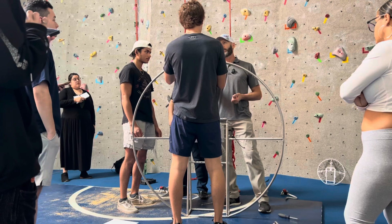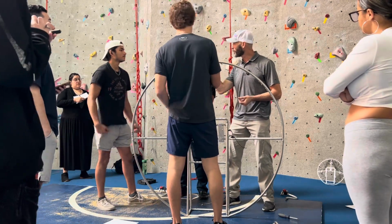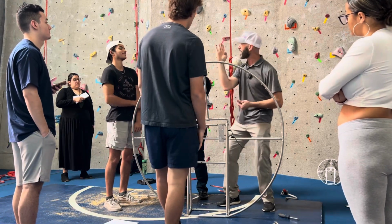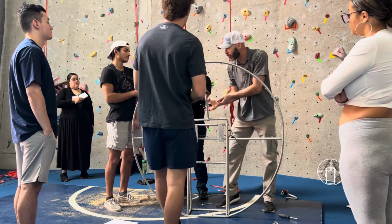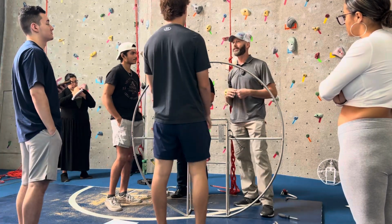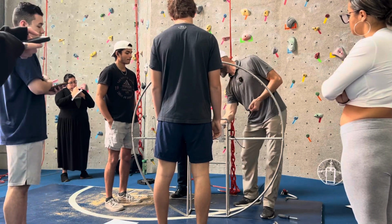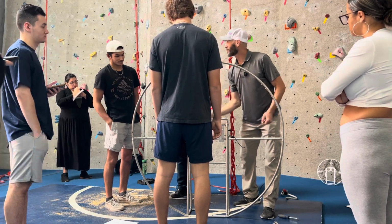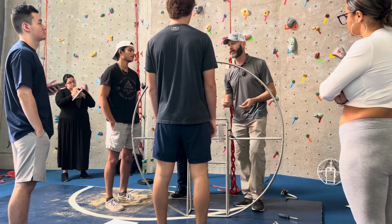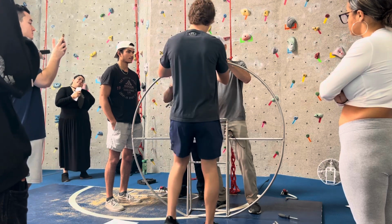So what happened was, with the ones I gave y'all, I learned from it. Y'all's was so thin, the foam was so thin, that it didn't cast well. I tried it at different angles to see if it was a gravity issue or the type of aluminum I was using, and I could not get it to cast. So on my Tuesday, Thursday class, I corrected for that error. Look at that, that's a half inch thick. I went with a thicker piece and had no problem. All of them cast out of that class. So it was the thickness. So this is where we have to be careful that we don't break anything.